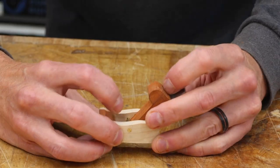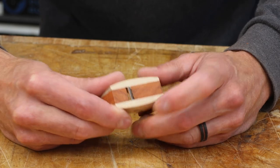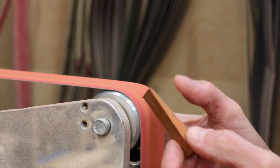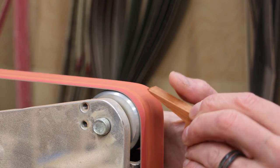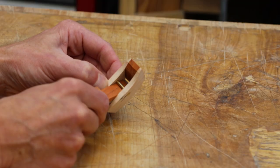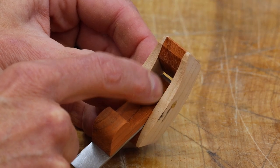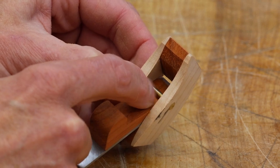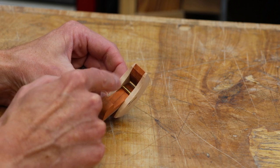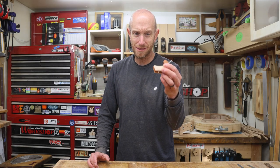As I'm test fitting the wedge, overall it fits really good so far, but the tip goes down almost to the end of the blade, so I need to shorten it up just a little bit on the belt sander. I'm also going to sand a very small scallop or bevel at the very end of the wedge — the shavings seem to exit the plane better this way, kind of working like a chip breaker. When I test fit the wedge now, that scalloped edge sits just above the edge of the blade. In the first tests I left that edge squared off and it seemed to catch the chips, but once I added the scalloped end it works much better.